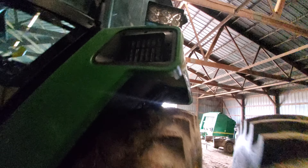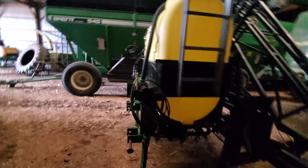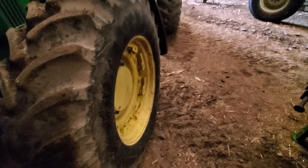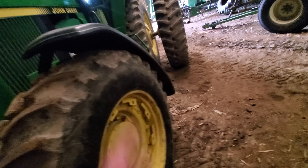Got more LED lights in here and LEDs right across the front all the way around. When we go to spray, all we got to do is move this tire to that side, that one to here, then we're going to unbolt the fenders for spraying corn. That way you can see the tire coming in between the rows of corn - you won't have the fender blocking. We don't have to readjust the whole fender; we'll just unbolt the four bolts and lift it right off just for spraying, then put them back on.